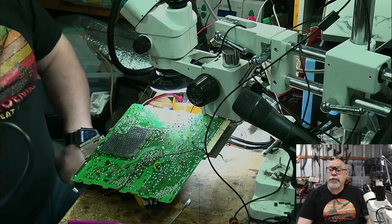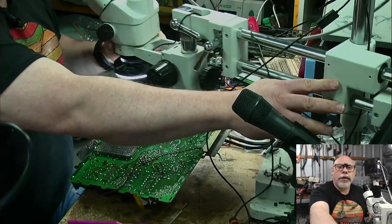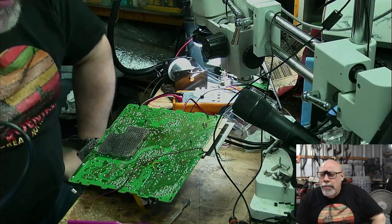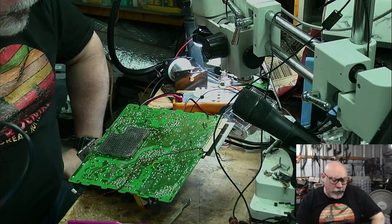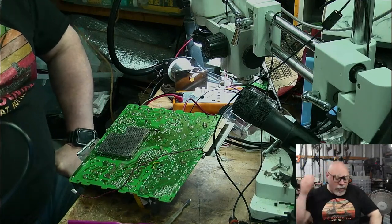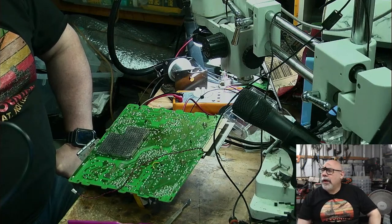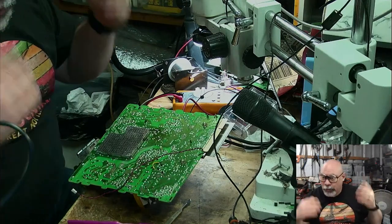40 megahertz 68030 for the 2FX. Yes, so thank you, Mr. Fahrenheit. You're a font of knowledge. And I mean that in a good way. They were just an amazing thing when they came out. The main problem with them is they used slightly different RAM SIMMs to the other Macs around at the time. I think they were like 68 pin or something like that. So none of the other Macs use the same RAM. Even if you get hold of a 2FX these days, you might struggle a little trying to find that RAM. The only other Apple device that I know of that used the same sort of RAM was, I think, a LaserWriter II NTX. I remember the place that I worked at, we had both, a 2FX and an NTX. And I remember we could put the RAM in one or the other.